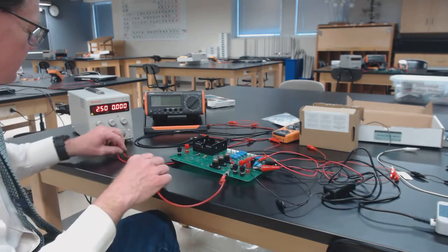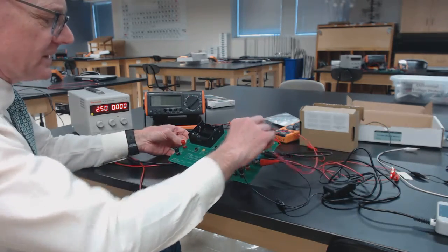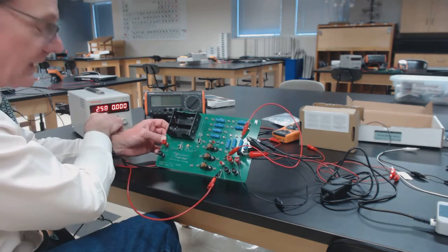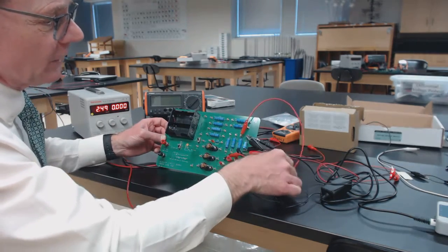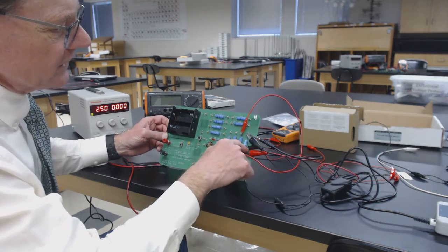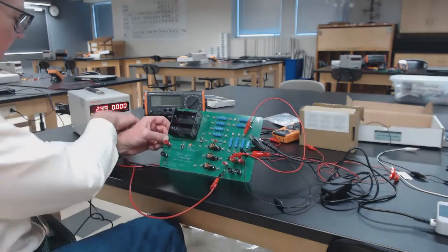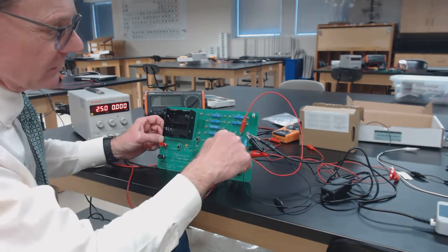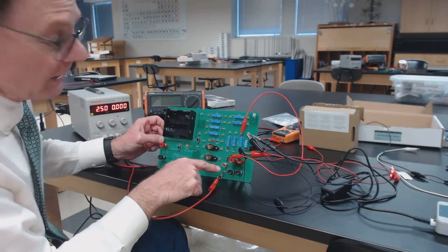When I push this button, let's trace where this comes in: the positive comes in here and then continues over on this side of this switch. When I push this button the rest of the circuit will be connected to the power supply — it goes around here, into this resistor right here, out of this resistor and into the capacitor, out of the capacitor right here, and goes right back into the power supply. That's a straightforward series circuit — the resistor in series with the capacitor.